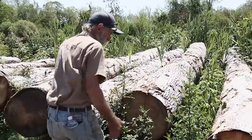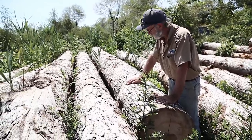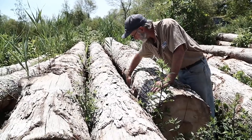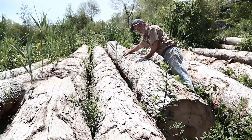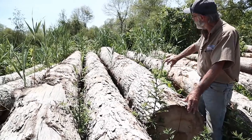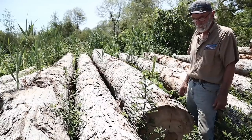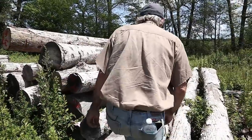Those humps likely indicate knots and imperfections inside. I did look at this log for my purposes and decided not to purchase it. It's got some bunches in it — areas where a branch broke off and the bark has grown right over. It gets worse going down, with a large bunch further along. Even though it's a very nice, fairly straight log, I'm worried it won't saw up to very clear lumber. You just never know until you open a log up. I'm looking for a log that's as straight and smooth as possible with no bumps — and I think I've picked one out in another pile.